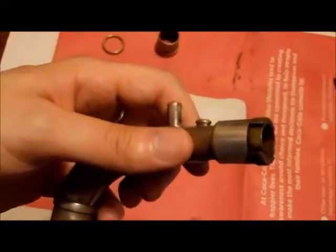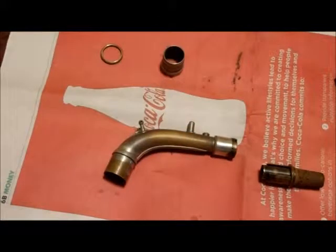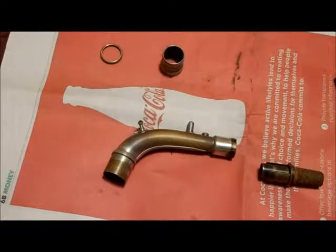We're going to grease this all up. When greasing, be very sure to get into all contact points where metal is contacting metal — that's very important because this is brass, a relatively soft metal. Without the gunk it looks very clean. The brass-on-brass threads haven't really been contacting each other since someone previously thought they were stripped, so they're looking really clean and I'm hoping once assembled again that holds up.